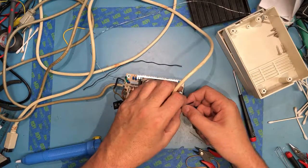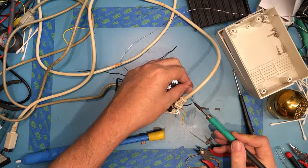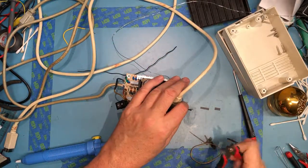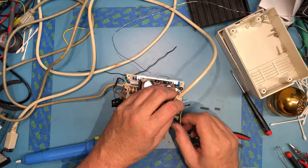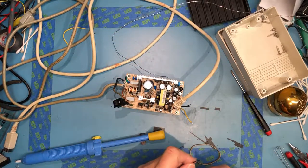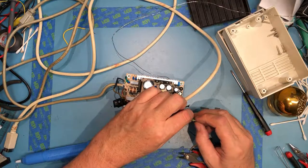I've got some flux in there on that lead, so now I'm going to heat the lead up again and flow some fresh solder onto it — hopefully get a bit better tinning. Yeah, that already looks better. The problem is the insulation on the wire here is not handling the heat very well. This yellow lead isn't particularly heavy — it doesn't need to be. I'll strip back some insulation and wrap the two leads together.